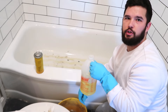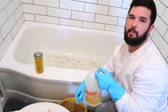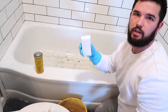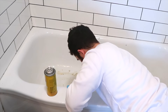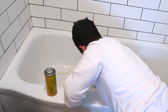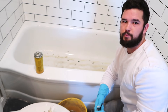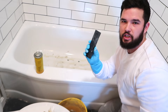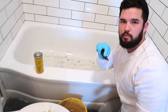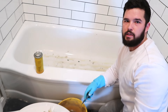If you had a spray bottle, you'd probably use way less. For that first pour we used about half a bottle, so definitely buy the spray bottle if your store has one. Now we're going to take the magic eraser and start scrubbing. One more tool that helps a lot is a plastic putty knife — I have a plastic shim I'm going to use. Definitely recommend using plastic and not metal so you don't add more scratches to your tub. It helps pry off some of the harder stuck stuff — in my case, drywall mud and the waterproofing material.